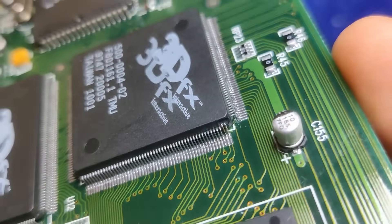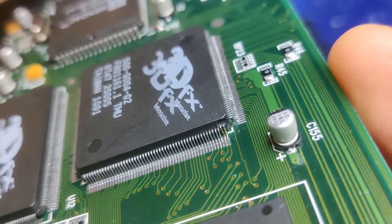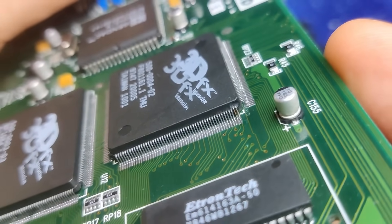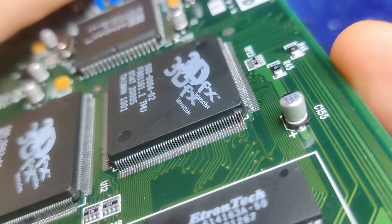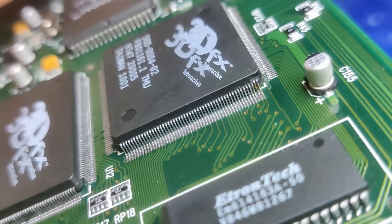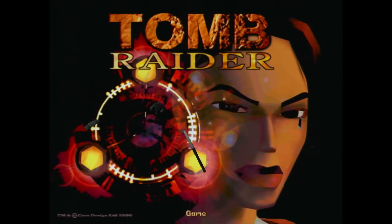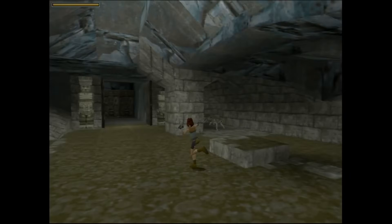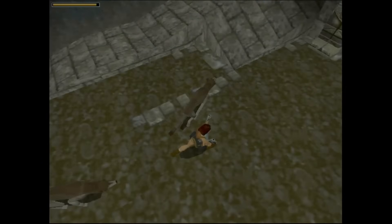The pattern of texture corruption is so similar that I immediately inspected that corner of the card once more. That one weak pin had disconnected while I was cleaning the card — I ended up replacing this pin as well, so now two pins have been replaced with copper wires in this corner. The follow-up test looks a lot better — the texture corruption is gone. The game started in 3DFX Glide mode and the Diamond Monster 3D seems to be working without issues.